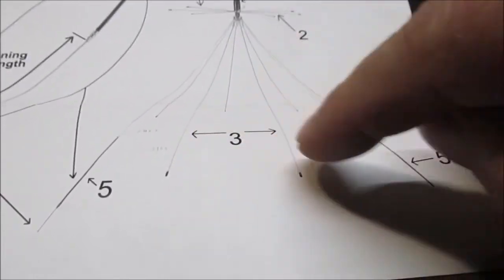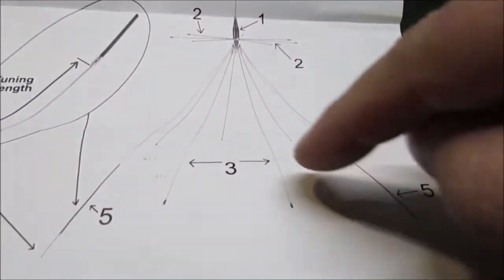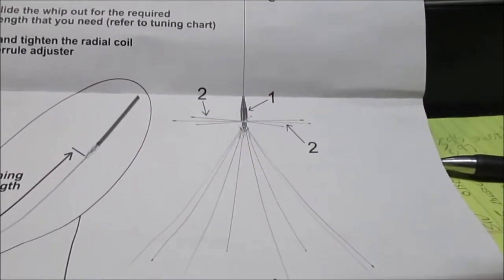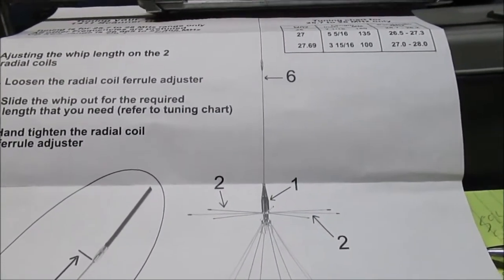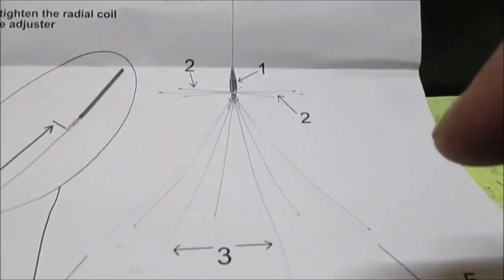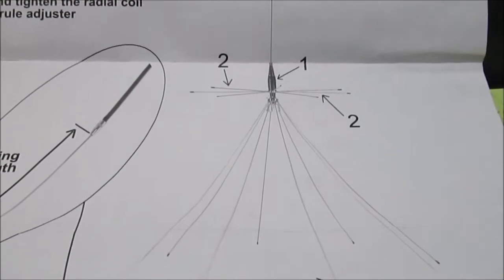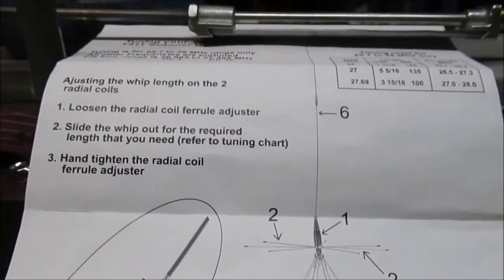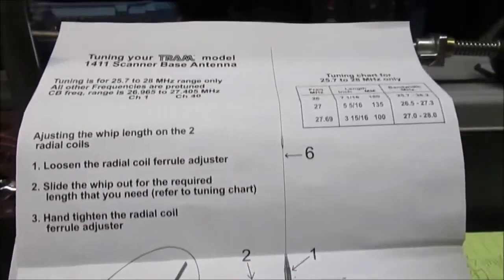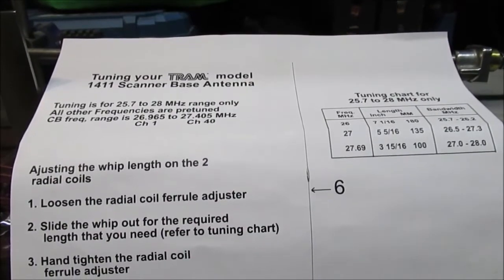As far as which way to point this: say your favorite direction is to the south — I would put these three radials to the south, and these to the east and west, to kind of use these as more of a reflector to bring the signal in. I listen to truck drivers way out there on the interstate to the south of me — I know they were really far away and I was turning it by hand sitting here in the chair. Inside is not going to be the greatest reception, but it's all I can do now with the bad weather. So thanks for watching — this is not a review, it's just to show you what it looks like.